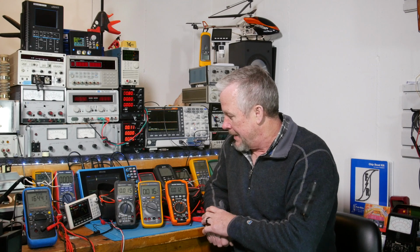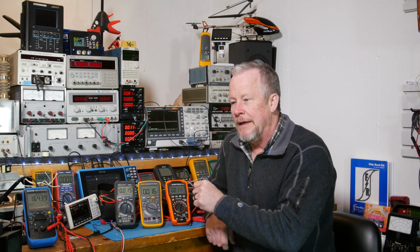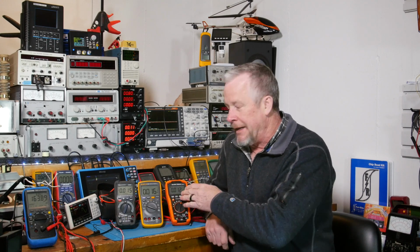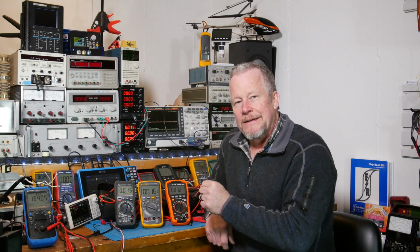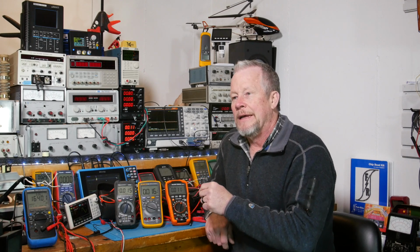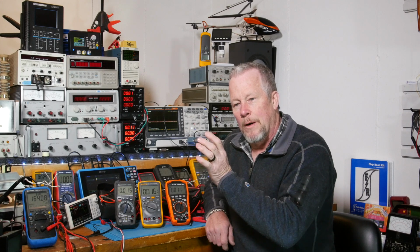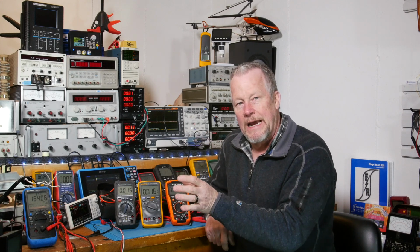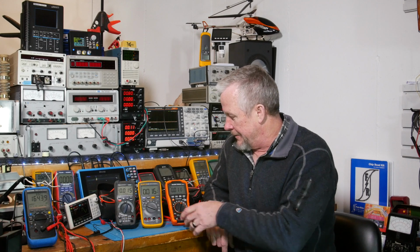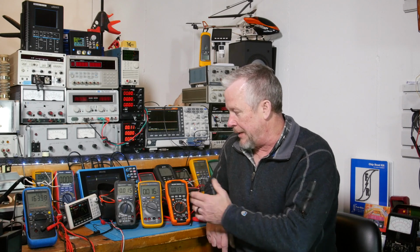And then, having a manual range is nice. Sometimes when you power up something and you know it's going to come up to, say, 48 volts, 120 volts, whatever it is, the meter's going to go through ranges and that might be distracting, and maybe you only want to power it up and then power it right back down, and you don't want to sit there and wait for the meter to go through the different ranges. So manually setting the range for, say, 100 volts or 400 volts or whatever you have, it is nice to have a manual range. So I think it's full featured. It's really nice. The double fusing, it's great when you have milliamps, microamps, to have two fuses.